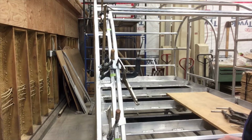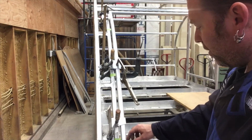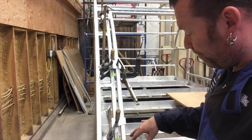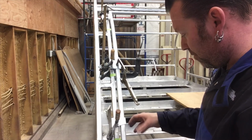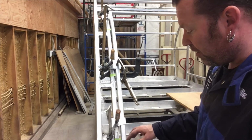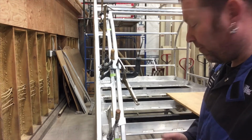All right, we're good. I'm gonna take it out, take a tiny bit off, and bevel the edges, because on something like this, I'm gonna have to grind it smooth because there's faces on all sides. Well, on most of the sides. So I'll bevel the edges so when I grind it, I'm not taking all the weld off.